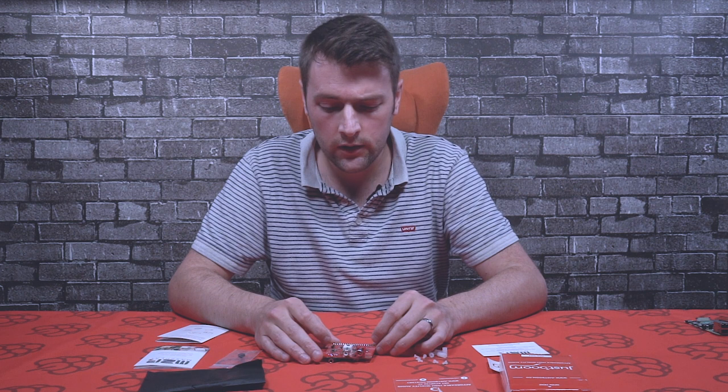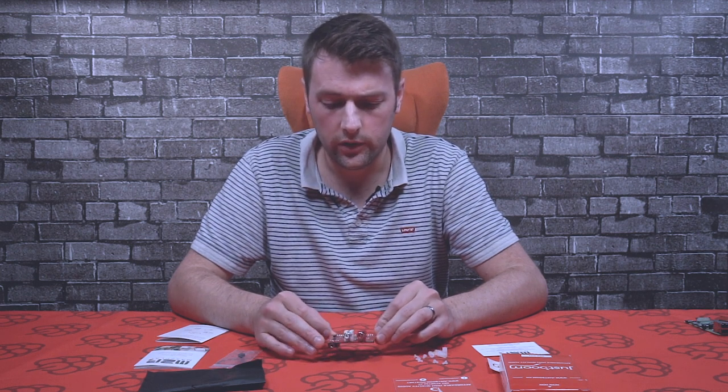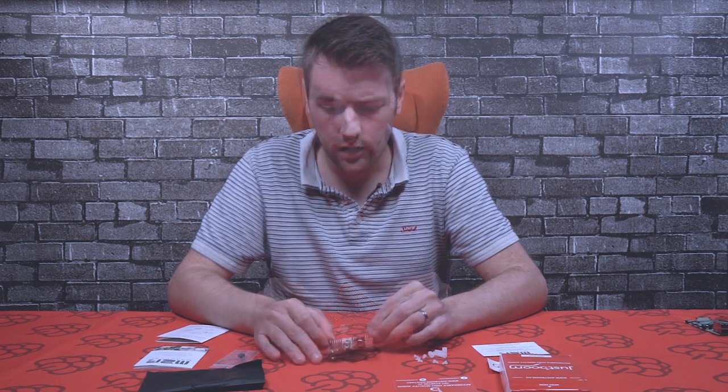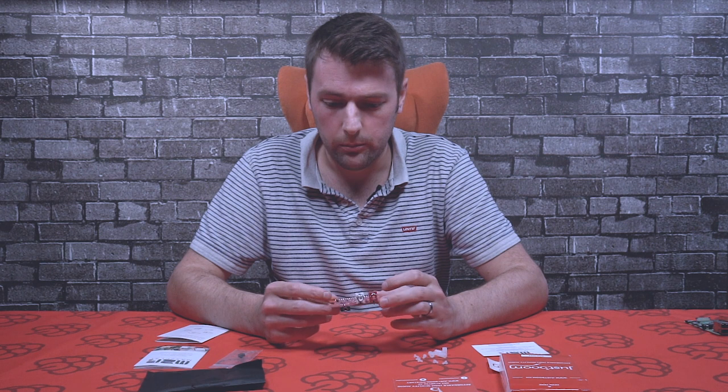This will work up to 384kHz at 32-bit maximum. When connected to the Raspberry Pi, the most it will do is 192kHz over 24-bit. If you want it to go higher than that, you have to actually reprogram the kernel. DietPi is one of the softwares that will push it further up to the 384kHz 32-bit mark. If you've bought the DAC hat and want to connect some speakers to it, you can actually purchase a standalone amp board and simply stack it on top of the DAC hat, which will basically turn it into an amp.